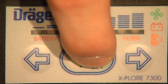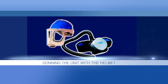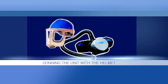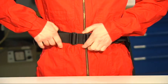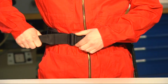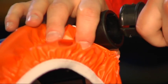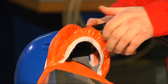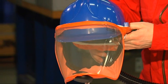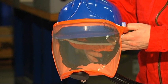Next, switch the unit off. Don the belt and adjust it such that it does not sit too close to the body and you can still move the unit — use the straps to adjust. Attach the selected headpiece to the respiratory hose using the bayonet closure, inserted and turned right. This safety helmet with visor offers a combination of respiratory and head protection and is thus versatile in its use.